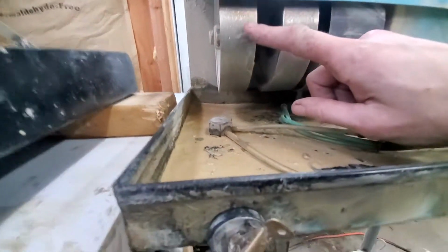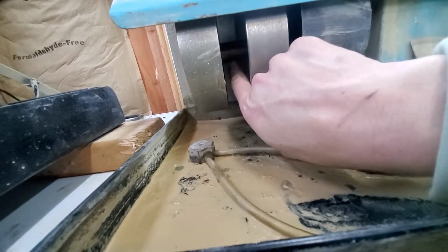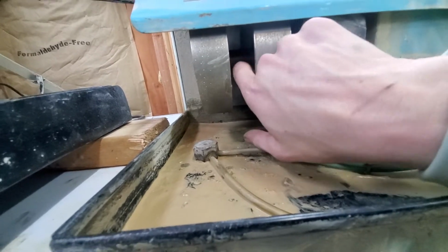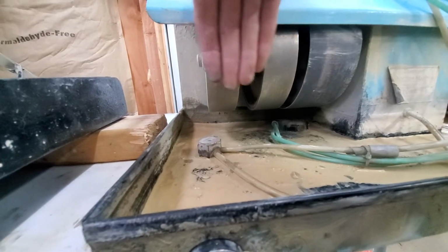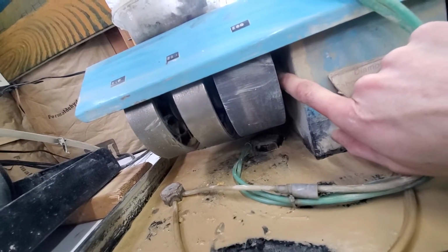So these wheels are on the shaft, and then in between is a dowel spacer, an arm basically that just spaces these. So once you clamp this on, you tighten it down, you're actually tightening all of these down to a key lock that goes around the shaft here. Same thing on the other side.